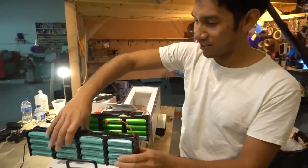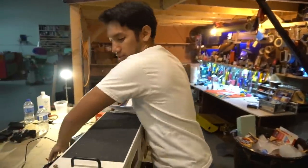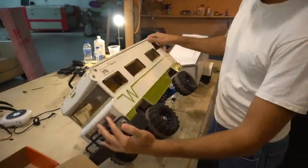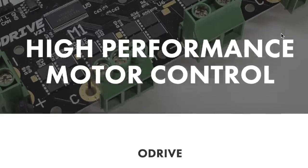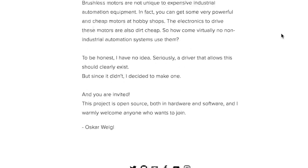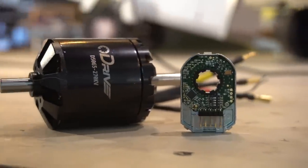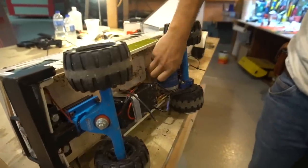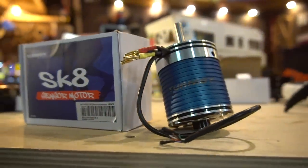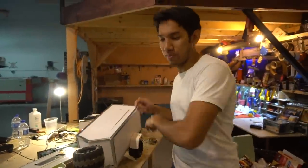And that was a lot of fun. We also installed in this board, if you notice in some of the shots, this thing actually starts from zero speed now, because Oscar hooked us up with these ODrives. They're really super accurate brushless motor controllers. Basically, you can use a Hall effect sensor, an encoder, or some other sensor to get really high positioning. These brushless motors are from Hobbyking, but they're designed for skateboards because they have Hall effect sensors in them, so you can start from a zero start. In the older video, we had to jump and push this thing to get it going.